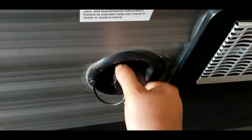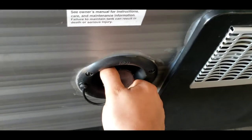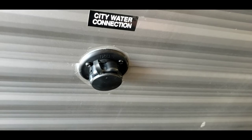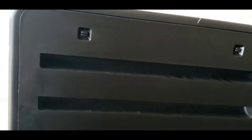Fresh water fill — this is where you will fill your onboard fresh tank. Just rest your hose in there, don't jam it in there. Monitor the progress on the monitoring panel on the inside — don't wait until you hear water squirt out everywhere to say you're full. Just like your water heater, I recommend draining that after every trip so it doesn't get stagnant either. Your drain for that is right there. Also, access to the back of your fridge for any maintenance and cleaning — make sure you keep it clean in here, and I recommend taking this whole panel off and cleaning back there every once in a while as well.